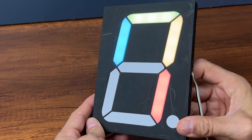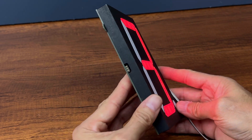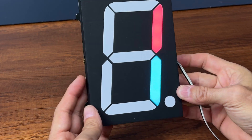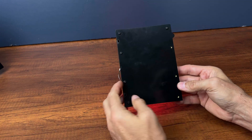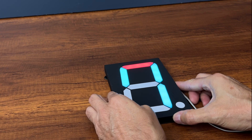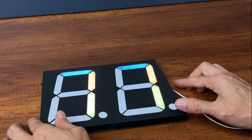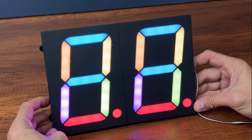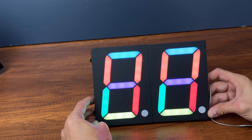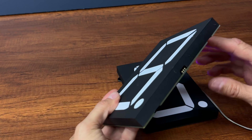The display has a thickness of just 14 millimeters and I use the PCBWay 3D printing service, which was created with a 3D printer in ABS. However, in the description you will find all the files necessary to print it with your own 3D printer. The segments were made of white PLA. I used magnetic connectors to allow multiple displays to connect without using cables. As we will see later in the Arduino library I've prepared, each single segment can be lit and colored.